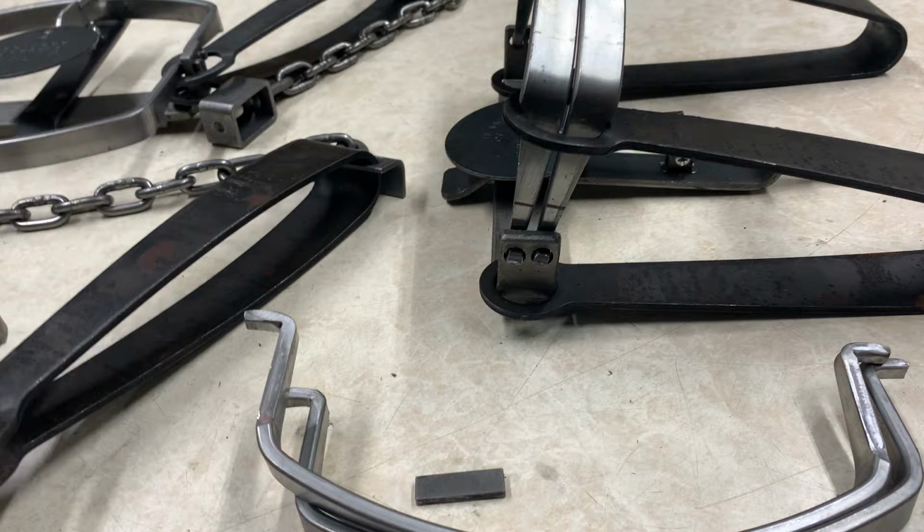Let me stand up here, get you a full measurement. There's your stock one there, 7.5. Here's your modified one. Six and a half. Just a hair under 6.5. So I figured I'd show this instead of with all the noise and that in the background, just in steps.